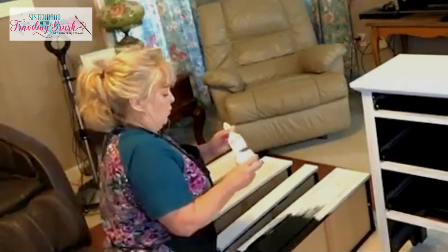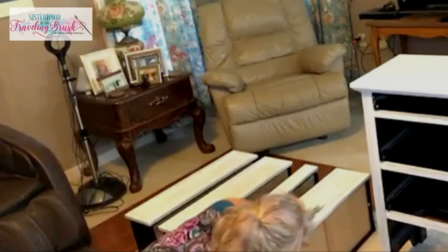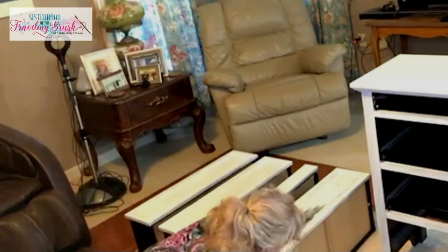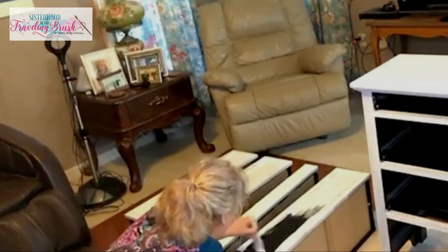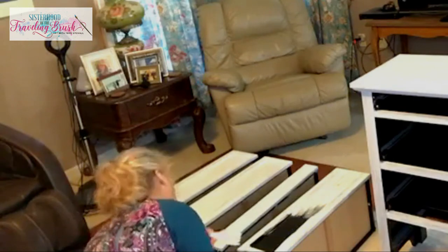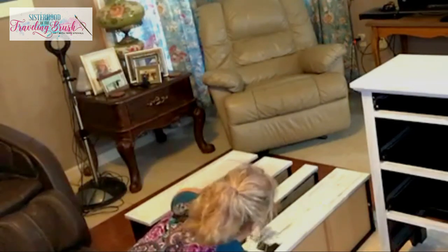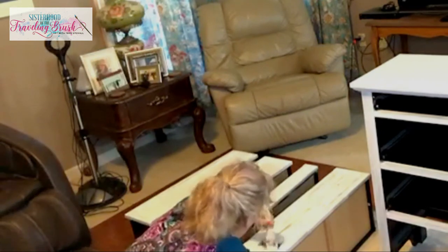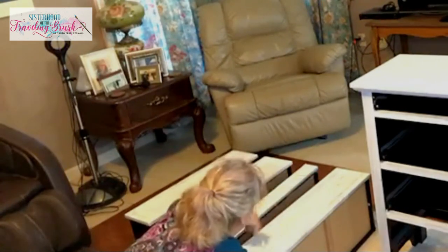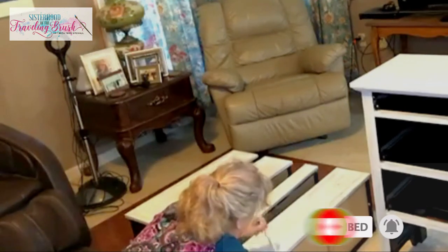I am not going to re-coat the whole thing. I'm going to re-coat because I tried this on the smaller piece and it worked — so I'm just telling you what I'm going to do. I'm going to re-coat the top, re-coat the tops of the drawers where they'll get a lot of use, and re-coat next to where the handles will be because I bought new hardware handles. I'm going to re-coat where those are going to be. I'm not going to re-coat those side panels — it will probably never, ever be touched there. I believe with all my heart, and it worked with the other piece, that one coat of this primer is going to be enough to help the paint stick to the surface permanently.